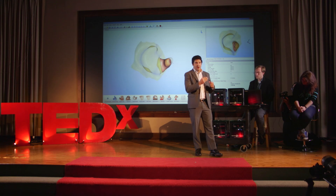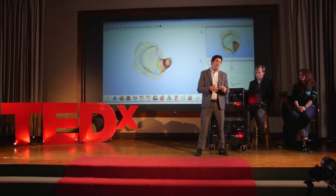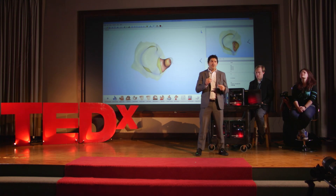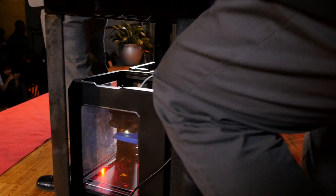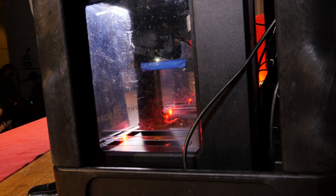One of the cool things about custom electronics is that each one is individually designed. When placing components — in our case a speaker — we can aim it so it's pointed right at the eardrum for really good fidelity. If we were doing biosensors in a wearable product, we could place them where we know they'd get consistent contact with skin, potentially decreasing the light needed for a pulse oximeter, or removing motion artifacts to produce a more efficient, better biosensor.